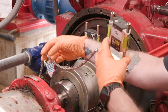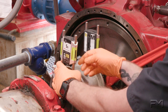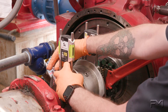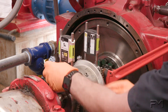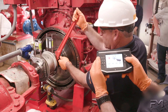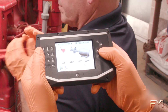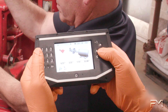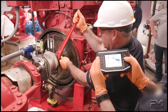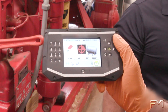This state-of-the-art system emits a pulsating laser beam that automatically determines relative shaft positions. The laser is especially helpful when aligning shafts that are separated by more than a few inches. The laser systems also have software that can calculate the shim changes required. The advantage of modern laser-optic alignment devices far outweighs the possible initial cost advantages of other, more conventional methods. The pump shaft is then rotated, and three readings are taken.